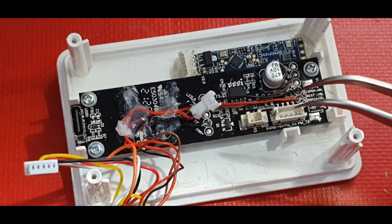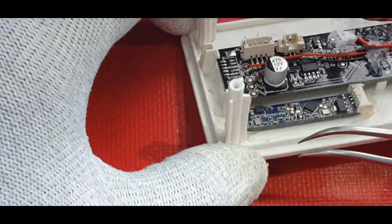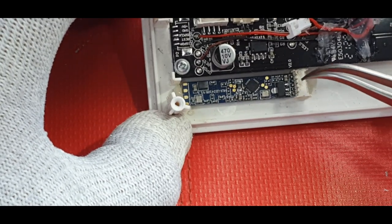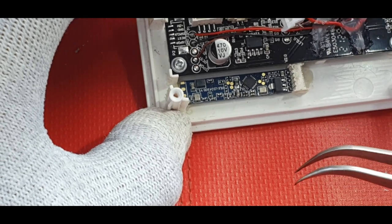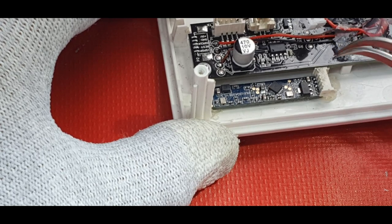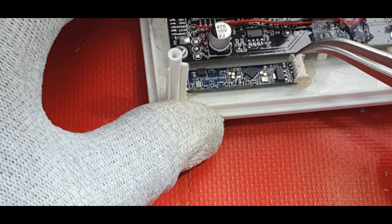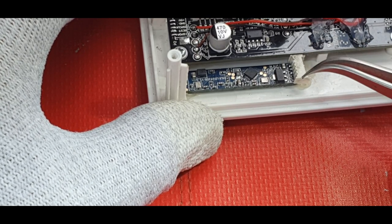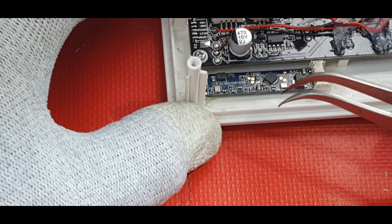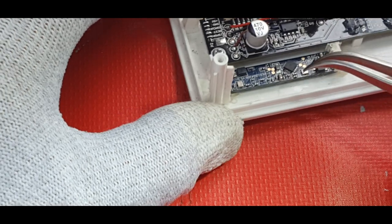With this modification all you do is power up the Mini D1 and get the data from the sensor. I've also glued in here with a little bit of hot glue a millimeter wave 2410, and I attached a 5-pin JST connector. I know you can buy the board with the pins, but it's not a JST connector - I recommend buying the bare board without the pins and just get the JST connector 2.5mm 5-pin and just solder it. It's much easier than trying to remove the header that it comes with.